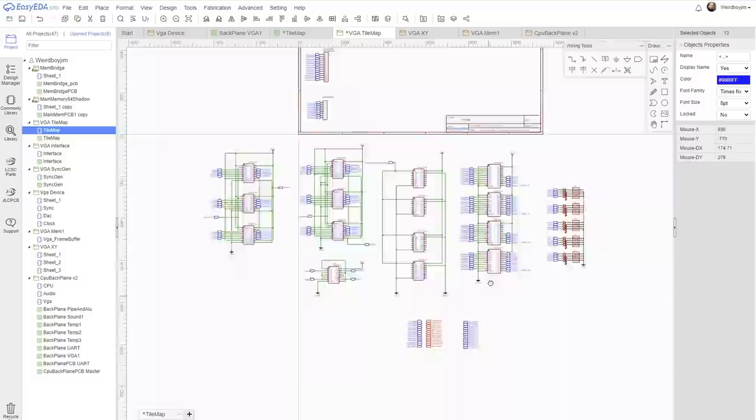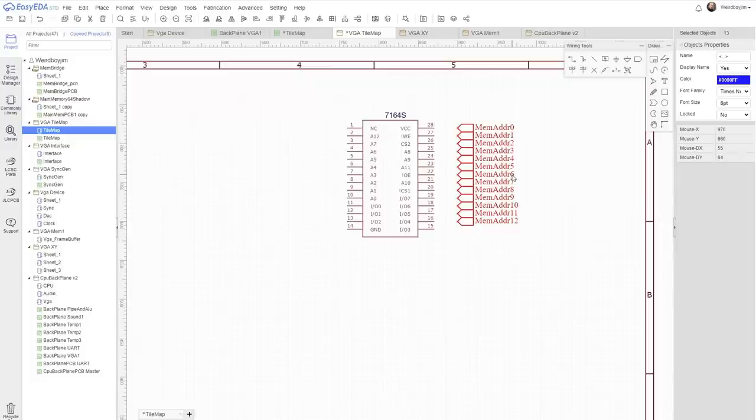This is where it's worth reminding ourselves that since we're controlling both the read and write to these memory chips, the address lines and data lines don't matter at all in their ordering. We connect A0 to address 0, address 1 to A1, all in order, but if we swapped a couple around, it would just swizzle the way the data was stored inside the memory chip. In fact, there's no guarantee that these lines actually line up with the grid inside the chip at all anyway. So I suggest we don't line those up until we know what's actually going to work best for us.